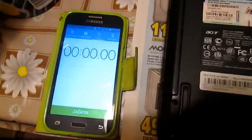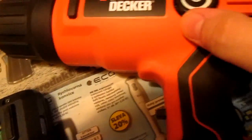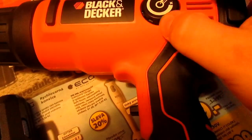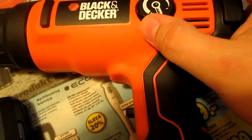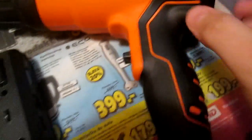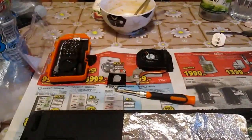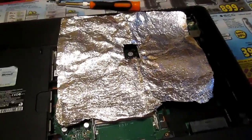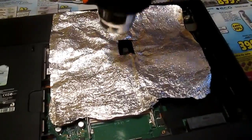What you need to do is slowly heat the chip on a flat surface to 200°C. My heat gun has a range from approximately 60°C to approximately 650°C. I will heat the chip slowly to approximately 200°C and then keep this temperature for approximately two minutes.